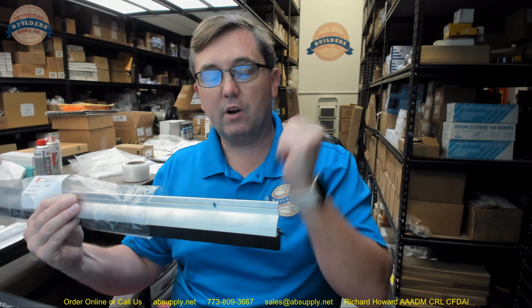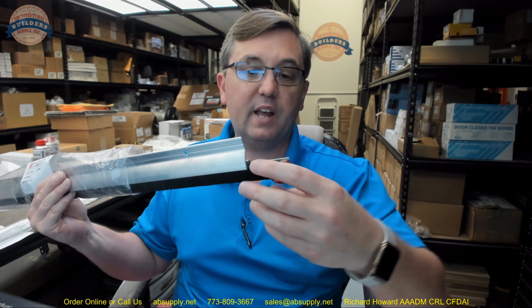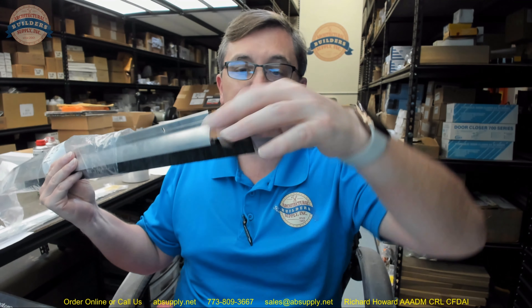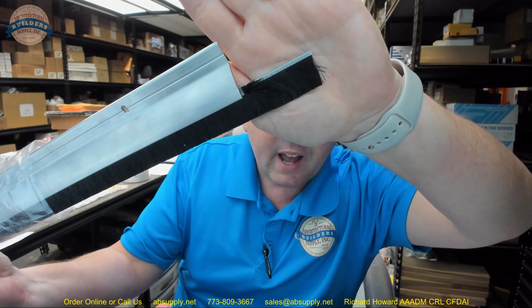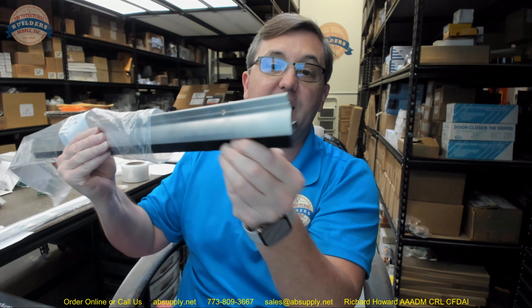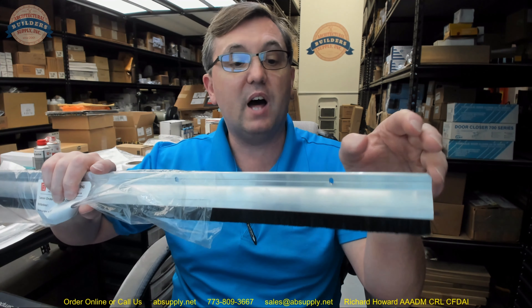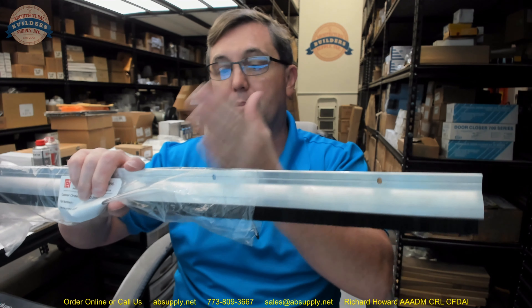If you toss this item into your chop saw and start cutting you will see some sparks because there are three different types of material: aluminum, bristle, and steel. The holder that holds the bristle together is made of steel. You will notice they cut that with a nib cutter — you will want to tug that out, cut it, and insert it back in. Then crimp the back side of it so it cannot slide in and out, because it will work itself loose eventually. If you ordered a custom length, we will not only cut it to length but also punch the first slotted hole at the proper distance and center-to-center spacing.